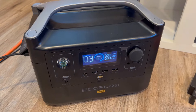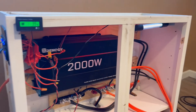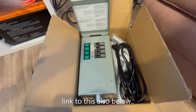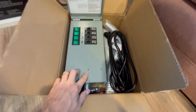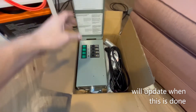I can't forget the LEDs we got up in the top here. I plan to have the electrician help me plug that all into a transfer switch — plug this into the main electrical panel to take your top four circuits and be able to power them from a plug that'll go in here from the system. So you can take your fridge, living room, whatever you want, and be able to use it on a semi-permanent basis or for backup emergency power if the power goes out. That's the next plan for the system.